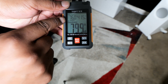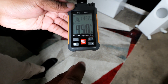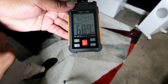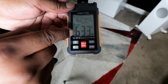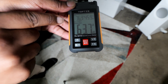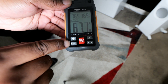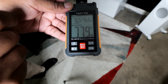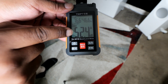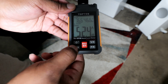The fast button controls how quickly you're reading your decibels. You can see it moving really quickly. There's an F and S button at the bottom right corner — press it to change from fast to slow for easier reading. You can also freeze the screen with the Hold button. Pressing H pauses the screen on its last reading, and pressing it again resumes.